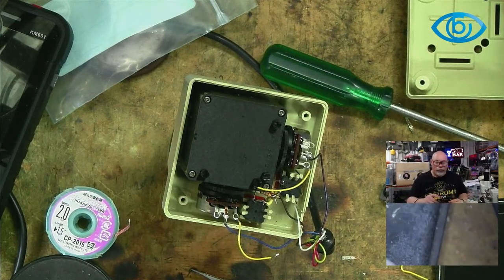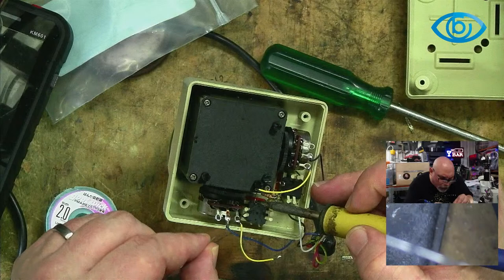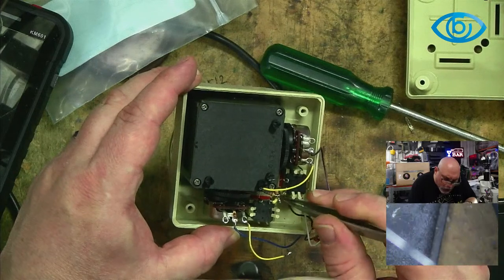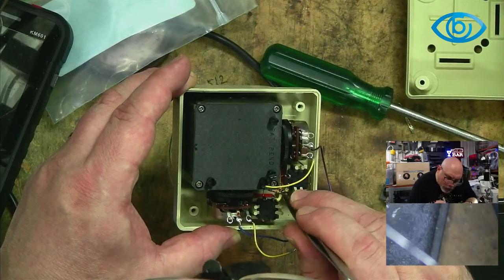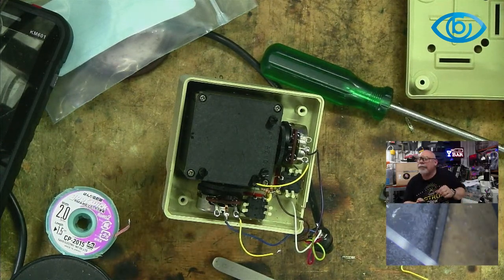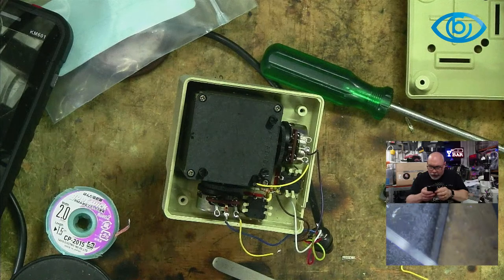It's interesting. I nearly had two working 2Cs. I had one that was fully working and one that was sort of working, had some problems. During my steps to diagnose that 2C, I accidentally sent 12 volts down the 5-volt rail. That's not something I do often, but when I do it, I'm never happy about it. There we go. Okay. I'm going to push this out of the way a bit because I don't want there to be any chance of that touching anything it shouldn't. Now, having said that, when I sent 12 volts down the 5-volt rail, I think it just killed one of the RAM chips, or maybe some of the RAM chips. I could probably go in and fix it if I wanted to devote the time to it.